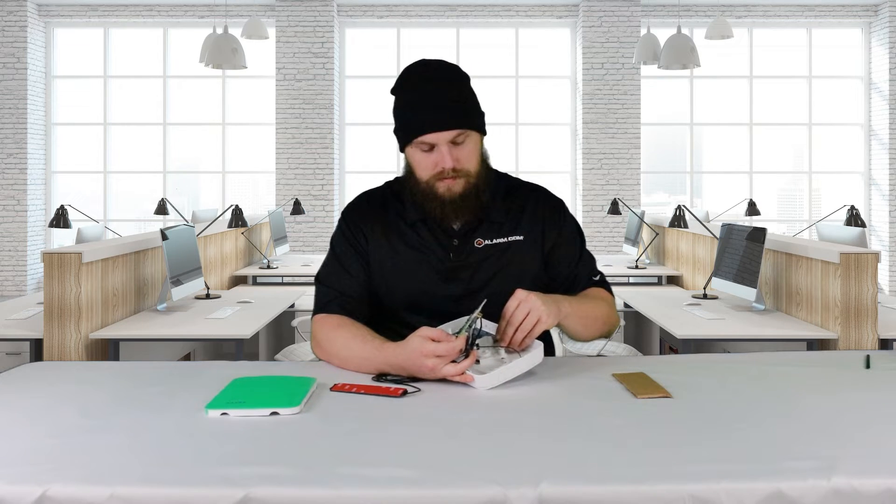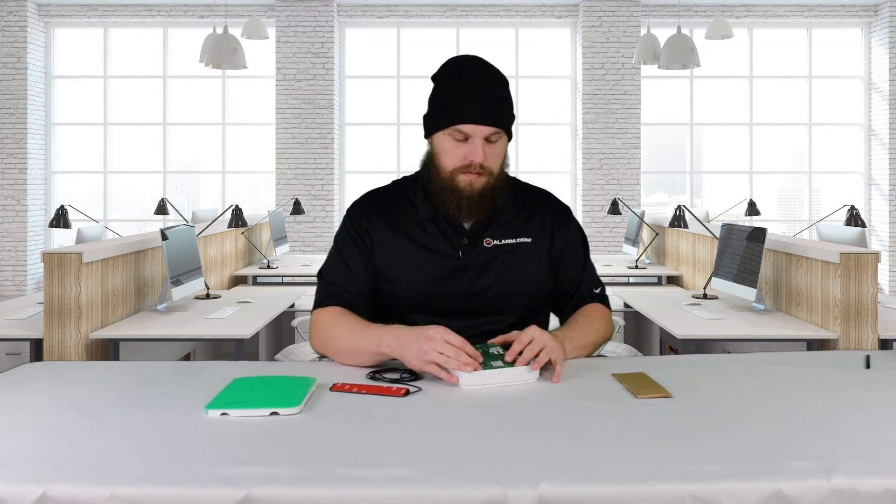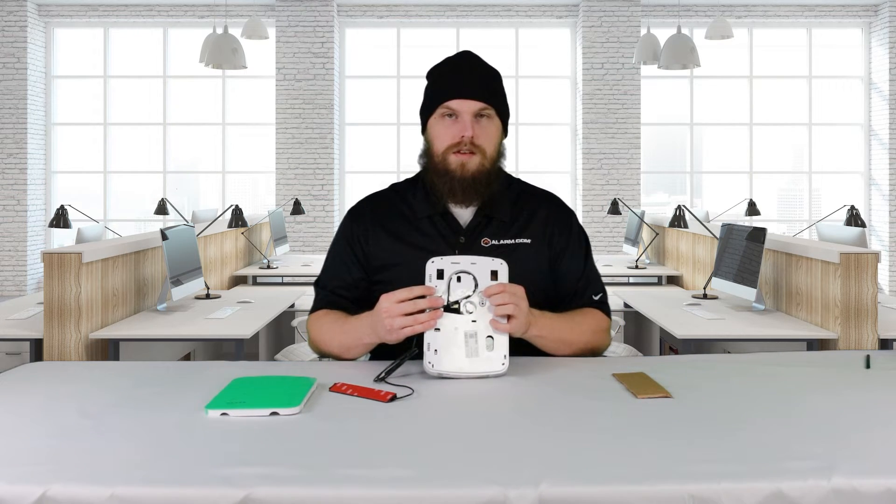So, if you've already mounted it with cardboard and done everything suggested and it's still not working, make sure that little rubber cover is on the button, then put the PCB back in and mount it down. That way, whenever that's on, it will push on the button on the back side of the circuit board.